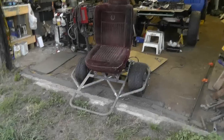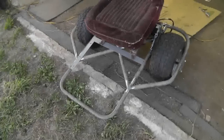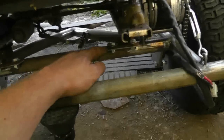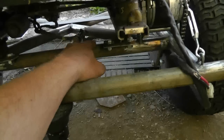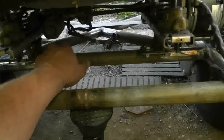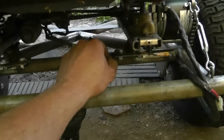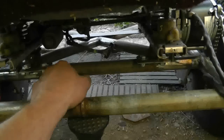So that's what the final mounting position is going to look like. The seat will have to move forward some, but the electric motor still works, so I'll use that. I made these little brackets — they're just basically pieces of plate — and they'll weld to the tube, level with the surface of the top of the tube. The front of this bracket is resting on the tube, and it'll be bolted at the back with two bolts. That'll be sufficient to support this thing because most of the weight will be resting on the tube; these are just to keep it in position.